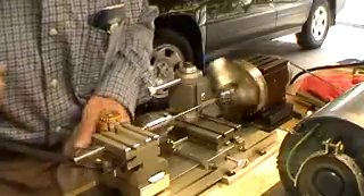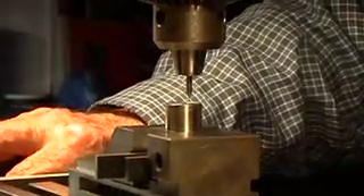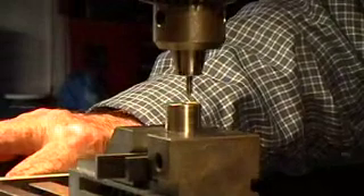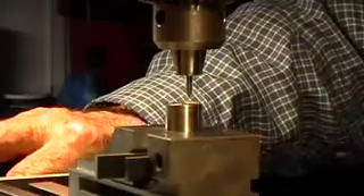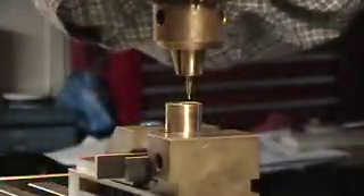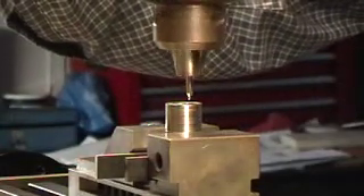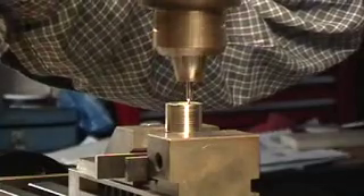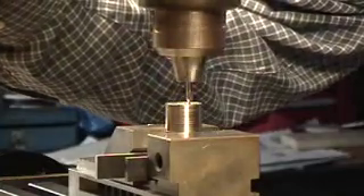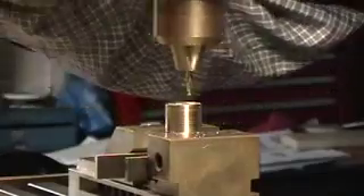Here I've indicated 0.25 inches away from the center of the billet. It's now mounted on my mill, and with a number one countersink — because it's a smaller hole — I'm going to spot for the drill. There we go.